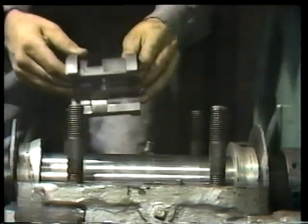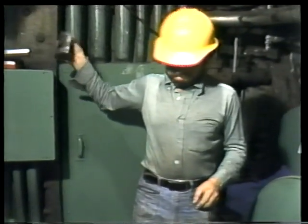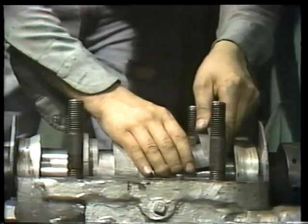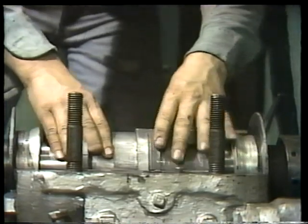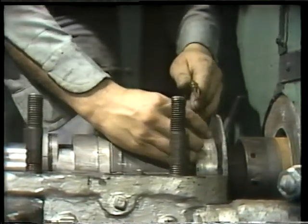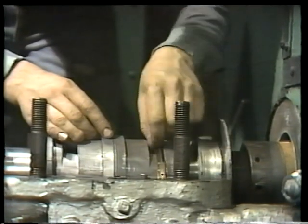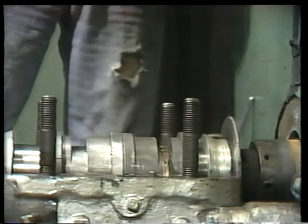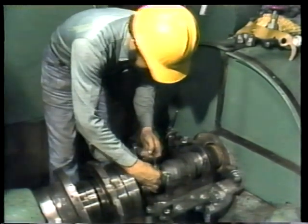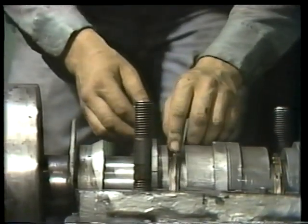Now install the upper bearing inserts — first make a last check to make sure they're clean and in their correct positions. Since the inserts are made of Babbitt, a soft metal, it doesn't take much to scratch them up, so fit them into place gently. Once the upper inserts are in place and lined up with the inserts in the lower shell, the oil rings can go on. Hinge them around an exposed part of the shaft, snap them together, and slide them over to the slot in the top of the bearing insert. Give them a quick test spin to make sure they're not getting hung up on anything. The oil rings bring oil from the bottom of the housing up to the top of the shaft — if they can't spin freely, the bearing won't get any lubrication.